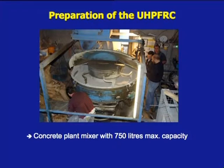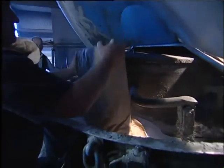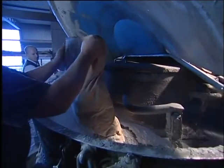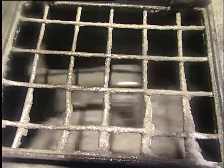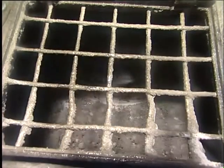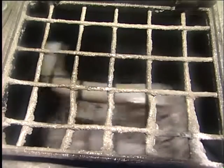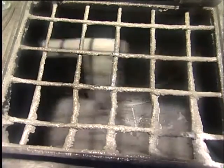This material was used for the prefabricated downstream kerb and for the watertight overlays on the bridge deck. The UHPFRC was prepared at a concrete prefabrication plant close to the site with a standard mixer of 750 liters capacity. All components except the macro steel fibers were dry mixed for 3 minutes before the addition of the water and superplasticizer. The transition from a dry to a fluid state of the matrix occurred within 1 to 2 minutes, despite the very low water-binder ratio of the material.